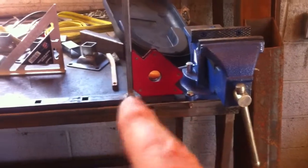All right, so I'm in the middle of making the railing, cutting these bars to 3 feet. And I'm bringing in the channel with the holes punched in it, and I just set it on this welding table, and I'm just going to assemble it here. So I just clamped these pieces down so that it's good and flat, and just going to go welding each one of them.